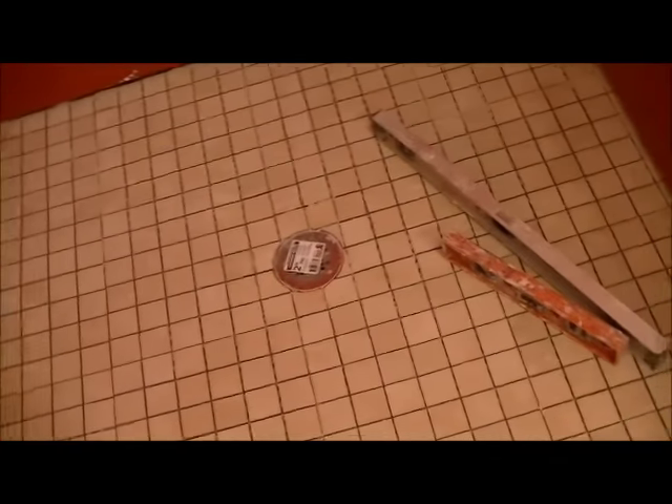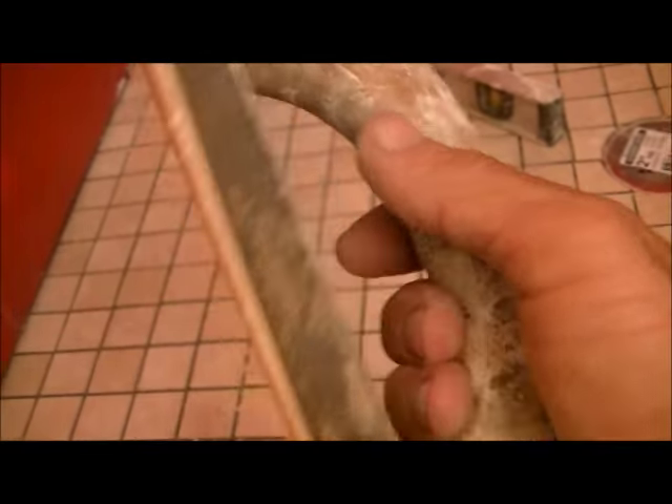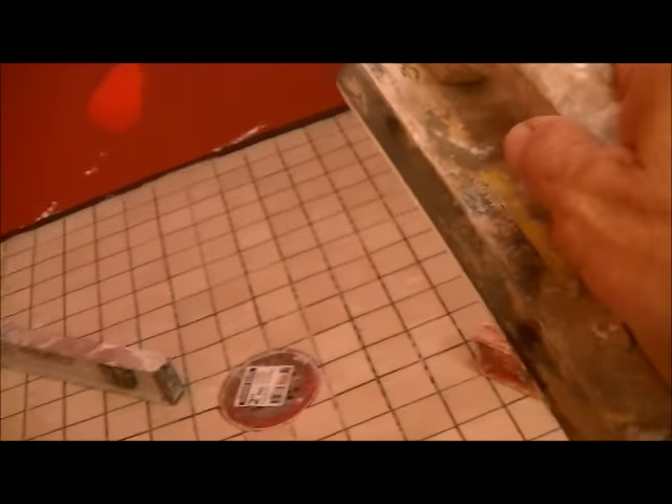There are a couple of things to be aware of when setting tile on the floor. The floor is never perfectly sloped down unless you use a product like Pitch Perfect. Use a quarter-inch trowel when setting this tile — that's a definite. Trowel out to an area you can work with; I usually work a larger area but you might want to work smaller. Also use a rubber float — the kind used for grouting — to push down the tile, because where mats line up you might get lippage. Pushing down gently across the tile as you set it will ensure no lippage.